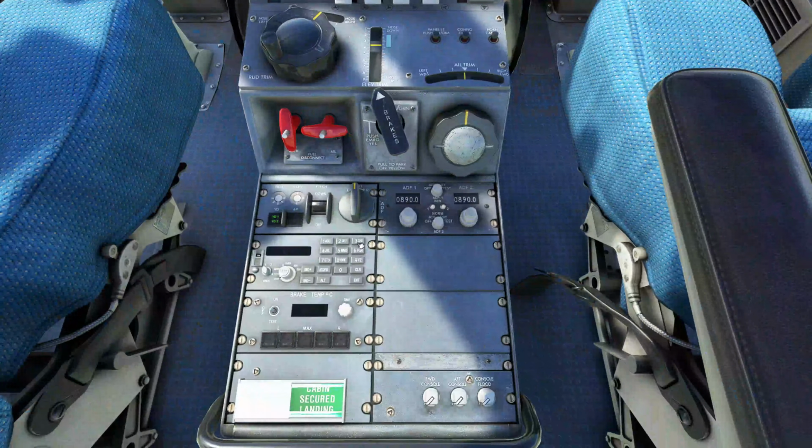So it's a 4-button switch. First push will give you the number, second push will give you the first letter, third push will give you the next letter. So we want B. Let it flash once and it moves over. So you're going to click it 3 times. B, C, and then there's 1, A, B. Oop. If you miss it, you can do it again. 1, A, B, C. BCC, and then it's going to be flight 1, 2, 3. There we go. Hit enter, locks it in, and then we will click on the ATC FID button, puts it back into the transponder code mode.